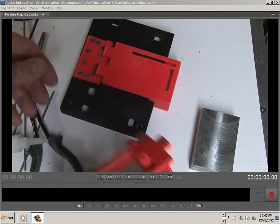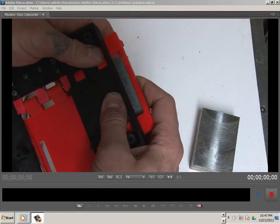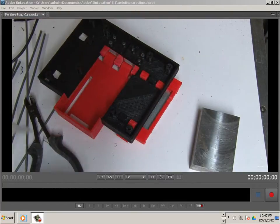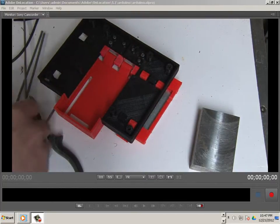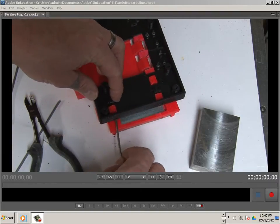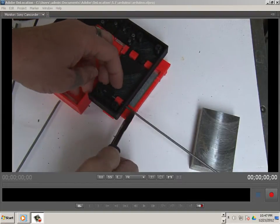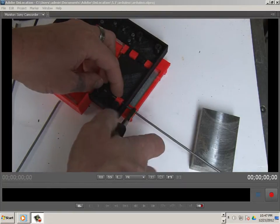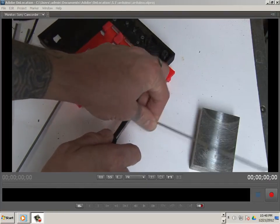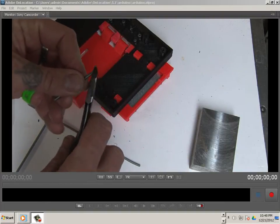So what I mean by develop a PLA spike that's short enough, it's much easier to do this now before you mount the lid. So you go like that. Then you find yourself a piece of PLA. Just like that. And you say, well, right about here is where I want the little tack. Perfect. Then I sharpen mine, so it's just a little easier to push that in.